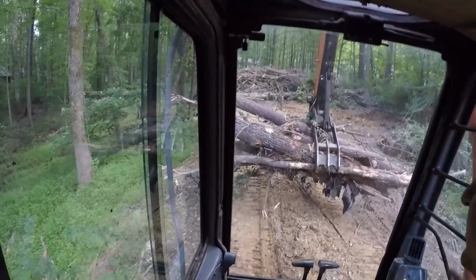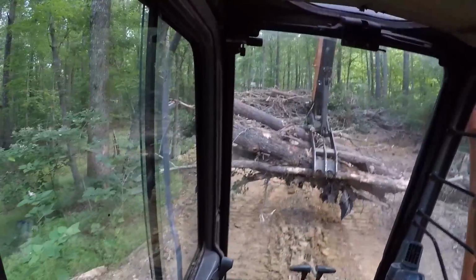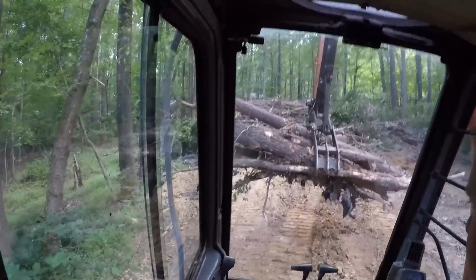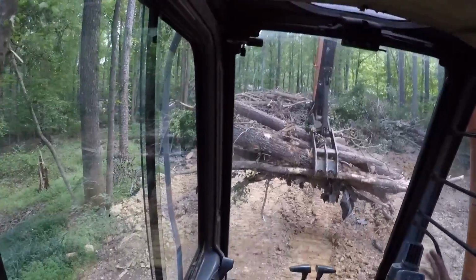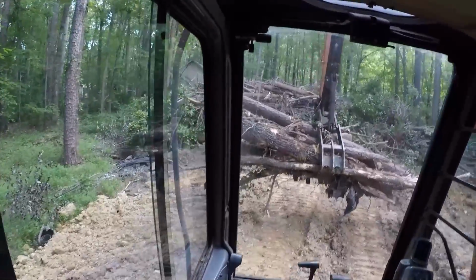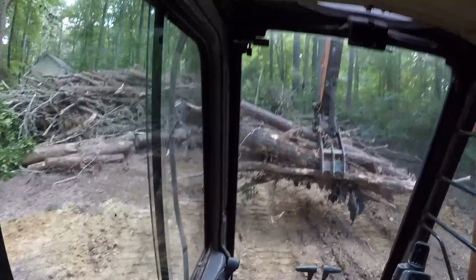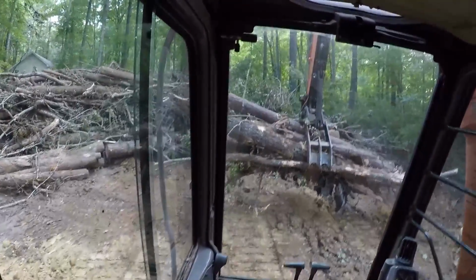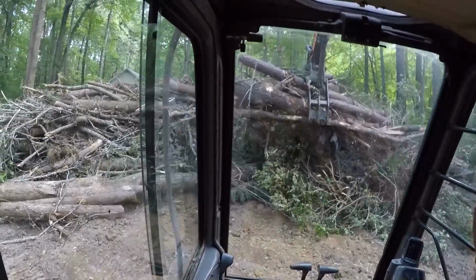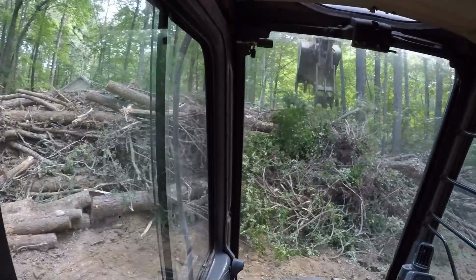You can pretty much, if you can get it wedged between the thumb and the bucket, you're going to have it. A lot of the hydraulic excavators, they've got the thumb set so weak so that the bucket cylinder can curl up and fold it up out of the way and not damage the cylinder. You can't hardly grab anything, which is slightly aggravating. But they have to do that so rookie operators don't bend the thumb cylinders.